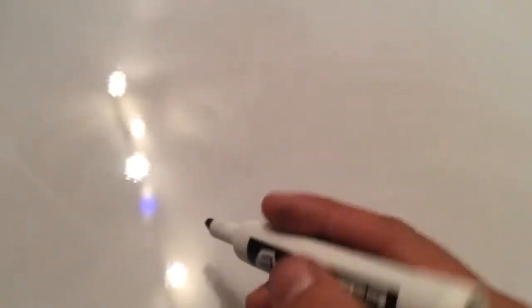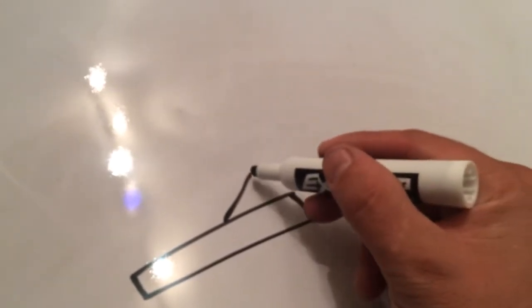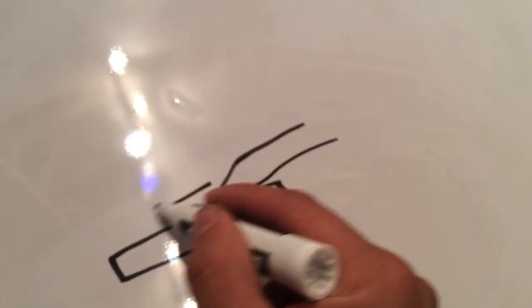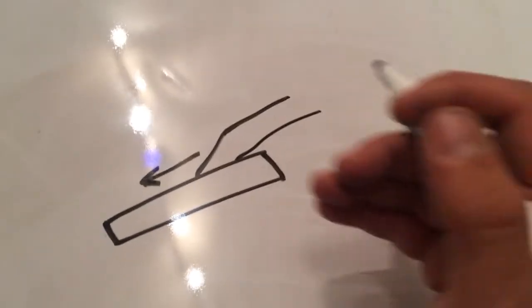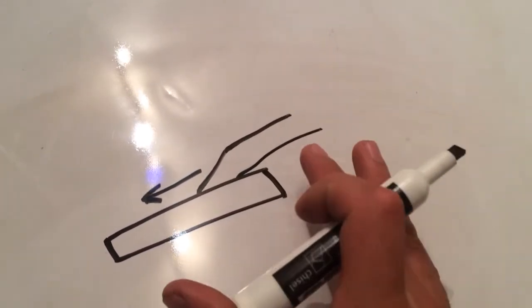So obviously you guys know how to sharpen a knife, so I'm just going to reinstate what we already know. There's your stone or whatever, and you're sharpening down your stone. So your V-ground edge is hitting the stone, laying flat against the stone. There's your flats, and you're just bringing it down your stone to maintain that V-ground edge. So, keeping this in mind, we'll talk about how I sharpen my Rocksteads and the method behind those, and why it's completely different than this, why you can't maintain it this way.